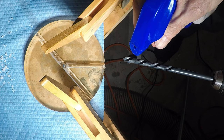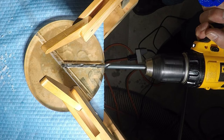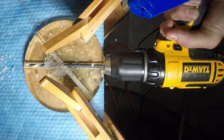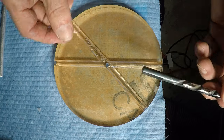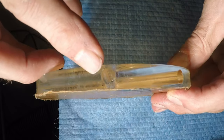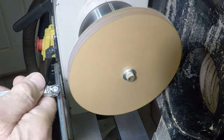So then I tried drilling a new hole at 45 degrees, since they all need to be at 45 degrees to each other. Putting lots of WD-40 in there — and that's breaking through just fine, getting a good start. That doesn't look too bad — let's try the drill bit in there and see if it fits. Wow, look at that! Okay, we have a plan. However, that was a worthwhile experiment because the exit side drifted off — that's because I was hand-holding the cordless drill. So I'm going to jig up again and do this on the drill press all over again, which means I need to make a new disk.